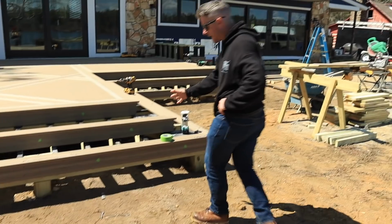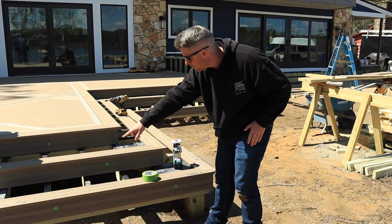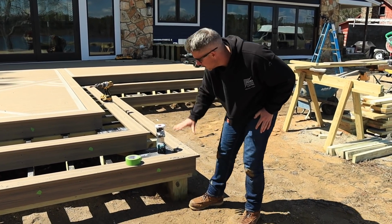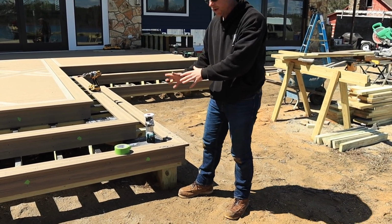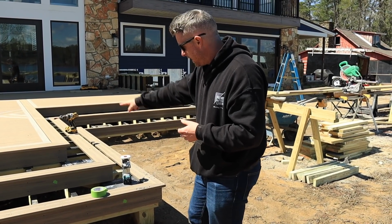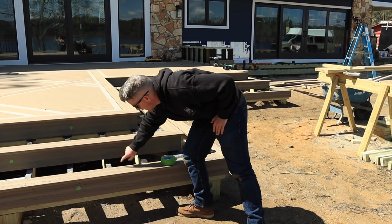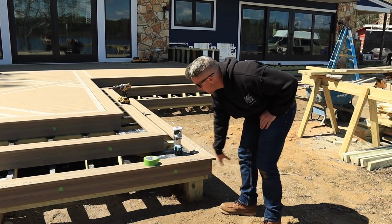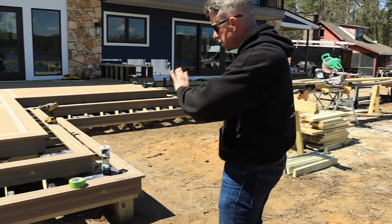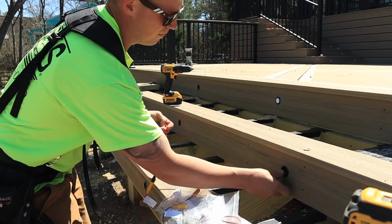Looks good. So you can see because we staggered them, our top and bottom riser lining up, but because this one is about 2 feet longer, we get an extra light here. So it looks like it cascades down this corner, but all the spacing is still the same. If you have them just in straight lines, it gets really wacky looking in this corner, because you could either go light, light, light, but then you have this big open space and it just looks a little weird. So we like to do it like this on wraparound stairs and a lot of lights going in here.